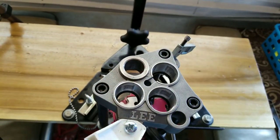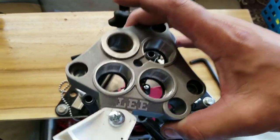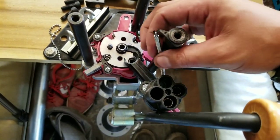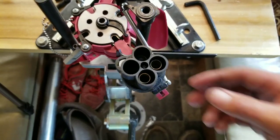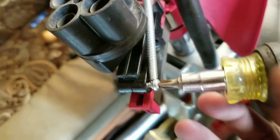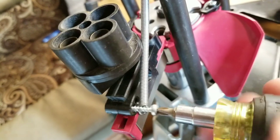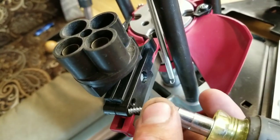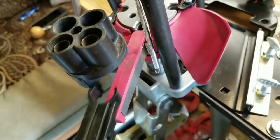Remove these three screws. Now that you have the three Allen heads removed, go ahead and lift up and set the top plate off to the side. You'll see that the press has the spring linkage system for the case feeder, which we'll remove next. That requires a Phillips screwdriver. Grab a nice quality screwdriver and remove the screw that's holding onto the case feeder. Once you get to the end, I like to put the screw right back in so you don't lose it. Then you can remove the whole case feeder.